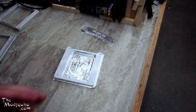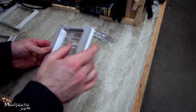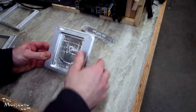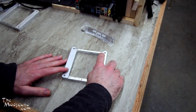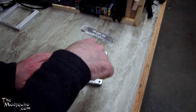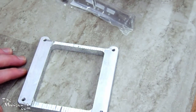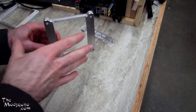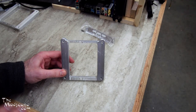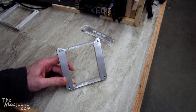Plan B, attempt one: I forgot to add a little offset and ended up with a nice aluminum drum, plus a chip weld that made its way around and foobarred that one. Attempt two: I'm not exactly sure how I screwed it up, but I got the Z-axis height wrong on the eighth-inch end mill, dragged the bit right across, and didn't do climb cutting so that didn't turn out great either. But this second attempt does work — I tested it mounted in the chassis with the graphics cards and it gets them low enough. It's just ugly.